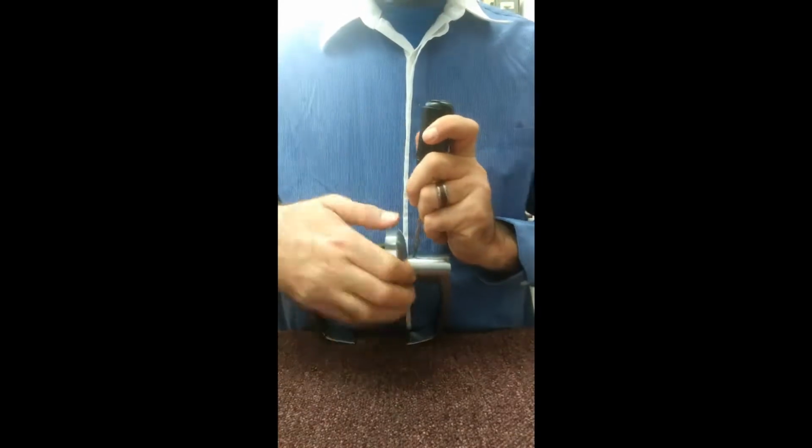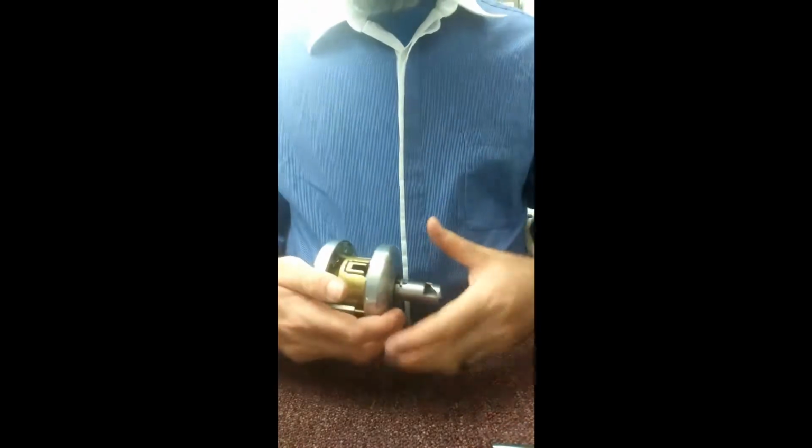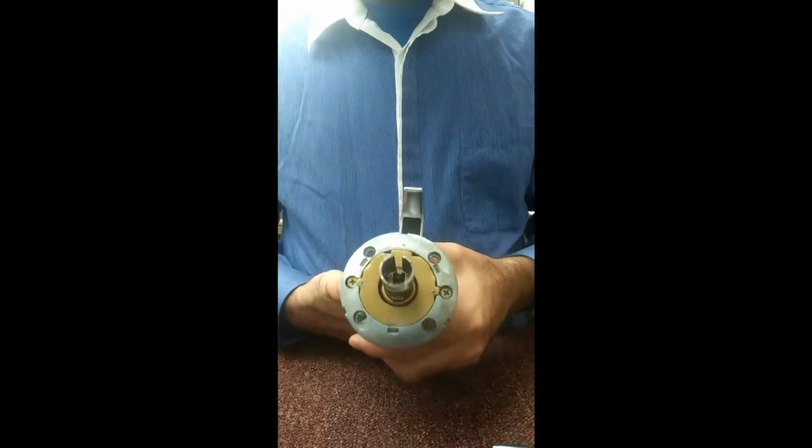So like anything, you always start at the inside lever. So press the pin, pull the lever off. What's also nice about this one, it also has the mounting post at 12 and 6, similar to the 10 line. But anyways, rosette pulls off the same way. You just gotta turn, pull, and you're left with the 2 mounting screws. Take those out.